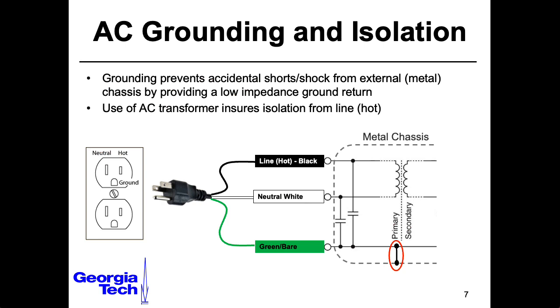Something I consider to be a great travesty is that in building wiring, the black wire is hot and the white wire is neutral. I consider this a horrible convention because in your typical electrical engineering laboratory, black usually indicates ground, and you usually use something like red to indicate the voltage. Sometimes the ground wire itself will be bare, sometimes they'll use green. Be really careful when wiring your house if you're an electrical engineer. I know somebody who wired some portions of their house thinking that black was neutral, so when they turned off the light switch, they were switching off the neutral instead of the hot. Very disconcerting.